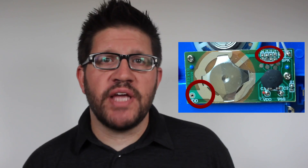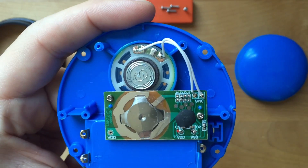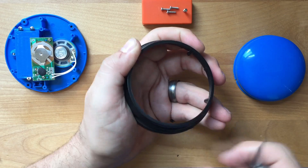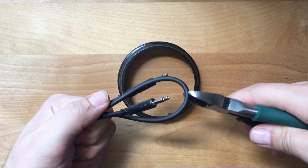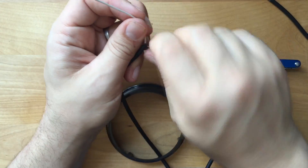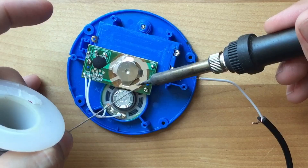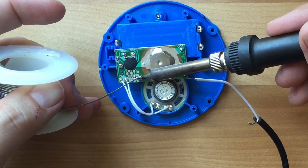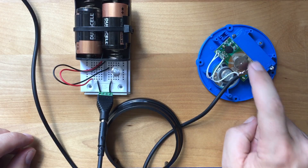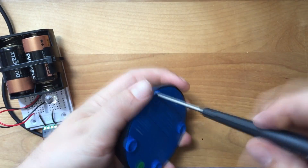So we just need to connect a couple wires to the two contacts the dome uses. There's some tape holding the dome down, so we'll put some solder here to connect it to the ring section, and here for the other contact. In order to make this work, we need to pass a cable through to connect it to these points. I want it to go through this ring, so I mark my place and make a small hole. I'm going to take a mono 1/8 inch audio cable and cut it in half. Then I'm going to pass it through the hole, strip off some insulation, and tin the tips of the cable. Then I'll solder the cables to those points. Let's test it. Seems good. I'm going to add a zip tie to make some strain relief. Let's close it up. Still works.